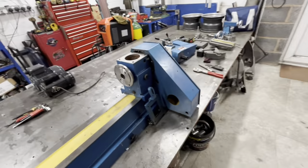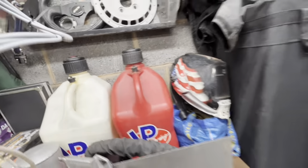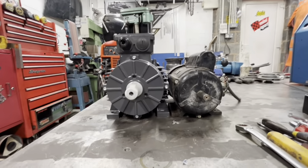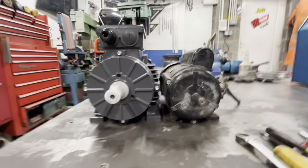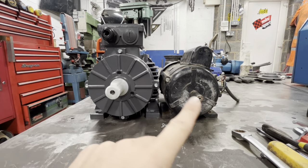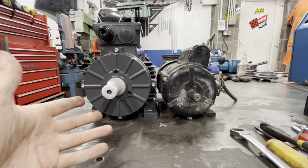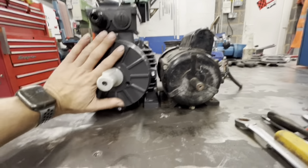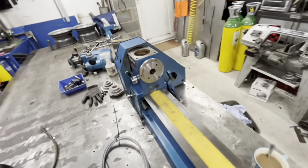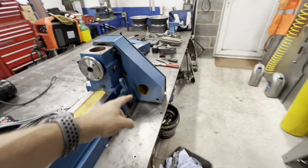The biggest issue with this lathe and the kit: so the kit includes the motor, the wiring, and the inverter that's in the box I've shown you before. The biggest thing is look at the difference in size. Not so much the overall size of the motor, but the actual mounting plate — this won't bolt up to that PCD. So we have to make an adapter to go on the plate so this fits. It's a lot bigger than it looks.